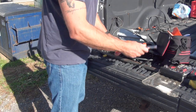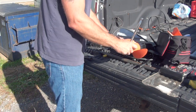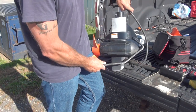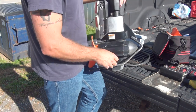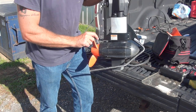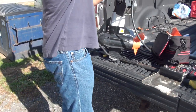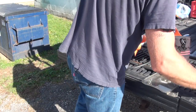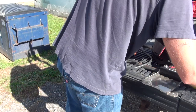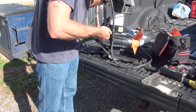So it's not a bad idea to check behind the prop every trip. I've noticed — and this happens when you fish an area that has a lot of vegetation — I have the rock guard here from Innovative Sportsman and it has somehow pushed its way up and gotten loose. I think that happens when you get a lot of vegetation that builds up on the grass cutter — that little stainless blade — and it can get under it and just pile up and push it up. So I'm going to get the right size Allen key on there and slide it back down. Looks like 5/32nds is correct.